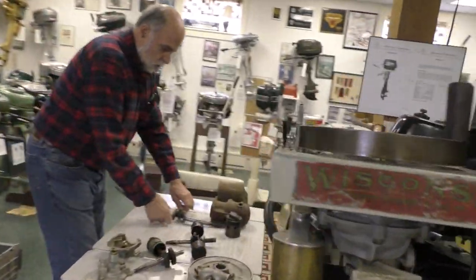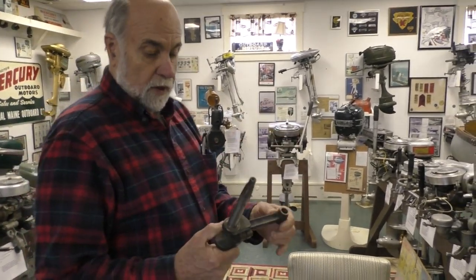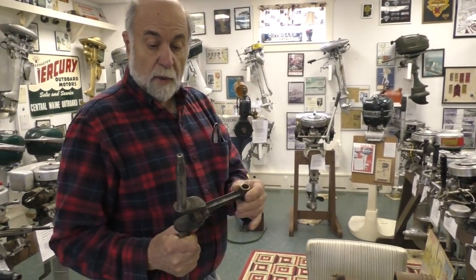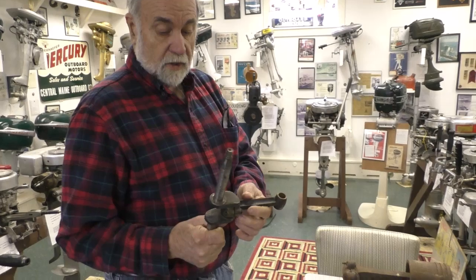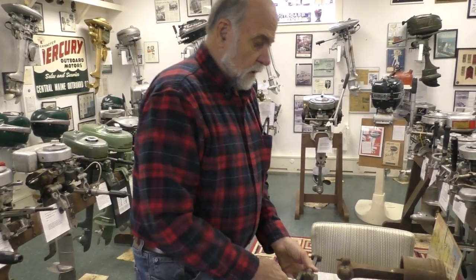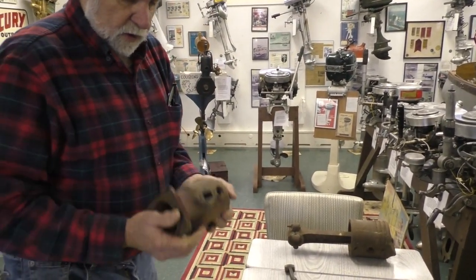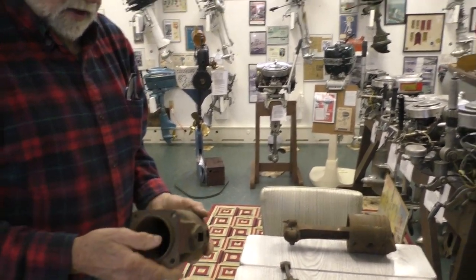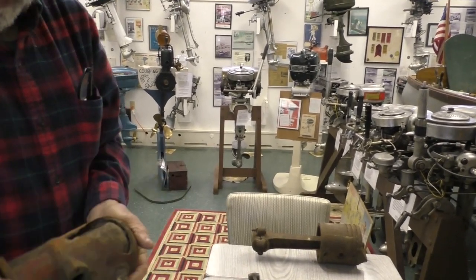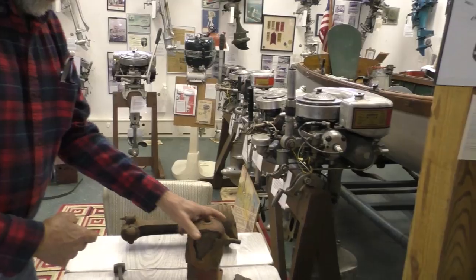Here is a typical internal crankshaft and connecting rod for that level of technology — a very simple drop-forged steel crankshaft with a bronze connecting rod, not counter-weighted in any way. The cylinder again, like the early one, is quite the casting. And they had cast iron pistons.